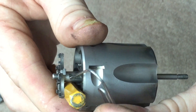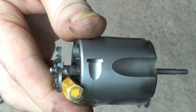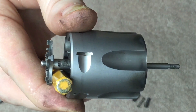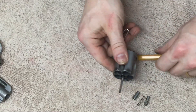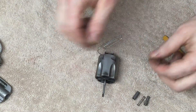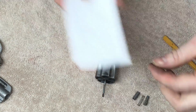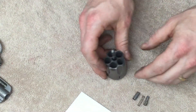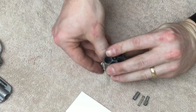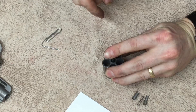If you notice there's a little hole in here, move this ejector rod around a little bit and you'll see a little pin in there. You need to push that pin out. You're going to want to face this down as you pull out your punch or paper clip or whatever you use to pull that pin out, because it's under spring tension.